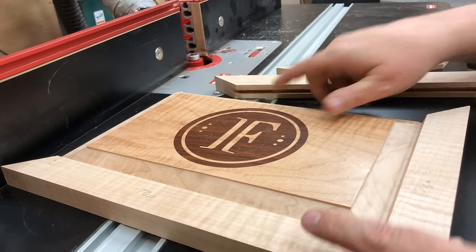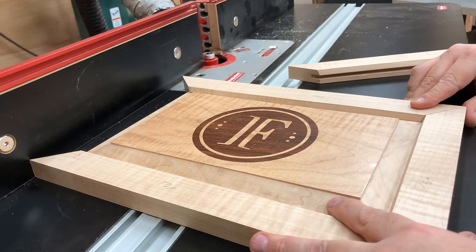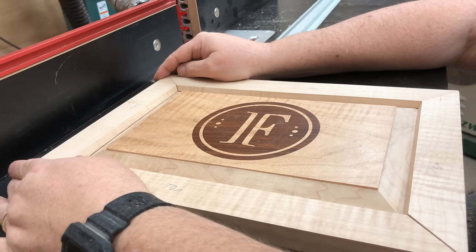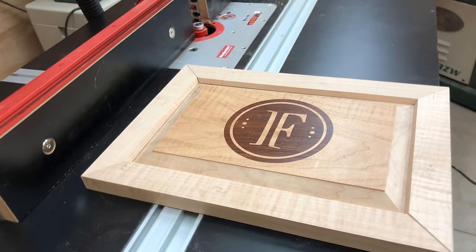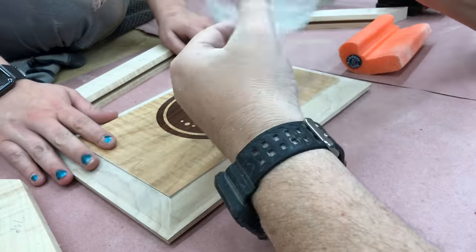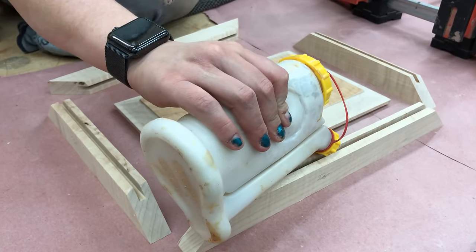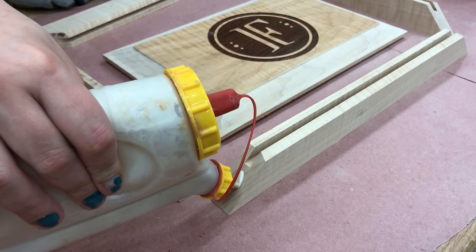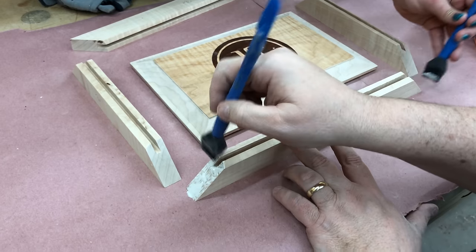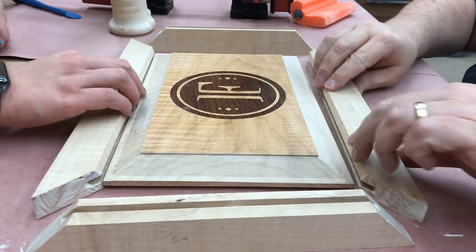And of course, every time I get something done or cut, I've got to go and do a quick dry fit and see what it looks like. And I like that look a lot, so I'm pretty happy here. Next, we'll need to sand this raised panel a bit. I like to use these foam blocks to do it with — I'll put a link to those in the description. There really is nothing better than this 3M flexible sandpaper. For the glue up, I like to put one drop of glue right in the middle of the panel — not really necessary, the panel could float completely. But I do want to coat all of the mitered ends very well in glue, and I like to coat both ends of every joint to ensure that there are no glue-starved areas. That's especially important in end grain, where a lot of the glue will actually wick up deeper into the end grain.